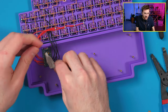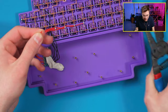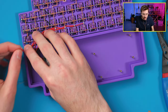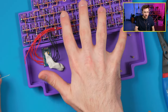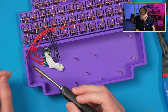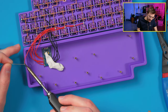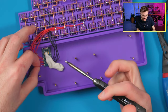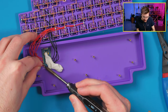I mean, it's a good thing because I have content for years to come, of course, but yeah, there's a lot of builds I want to do. I want to maybe design my own thing with Ergogen. I have looked into doing some splayed pinky layouts, where the pinky goes further down. But that's the thing with hand wiring: it's really good for non-traditional layouts, right? Especially ergo stuff, because you can't really make PCBs. I mean, you can mess with a flex PCB, but hand wiring is kind of where it would shine.